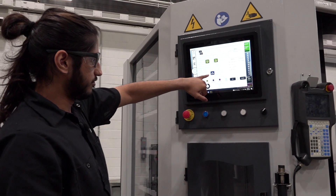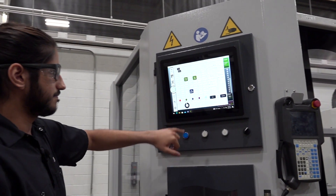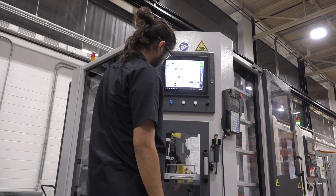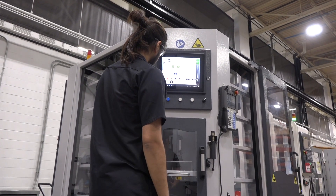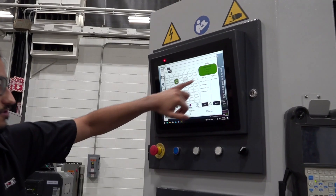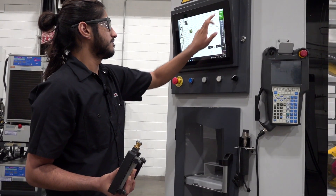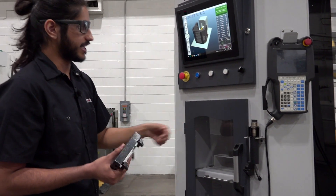Right now it went blue because it's machining, and then when it's done it'll go green for machined. So it keeps track of where the part will be and where it needs to get the next one from. It just finished this part and it's about to give it to me. You can see it just updated — it moved it from slot 3.2 to the WSS. I can go in, pick up my part, and now it immediately queued a part for unload, and it'll take the next one and immediately bring it out to me.